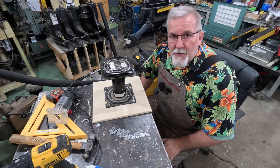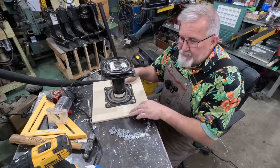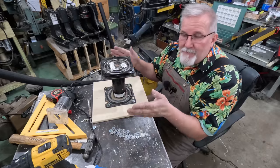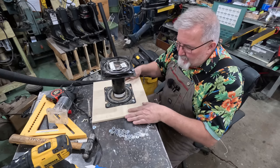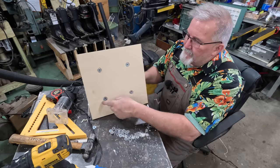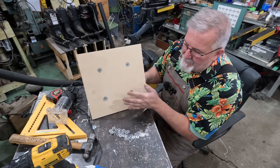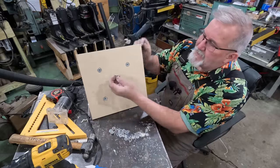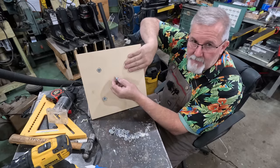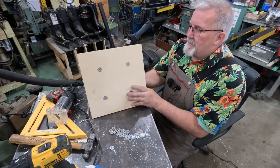Folks, let's catch you up as to where we're at right now. I've obviously cut the boards. I just ran them across my corner rounding router setup that I have on my little bench for knocking the corners off, so we don't have any sharp edges up top. We took the router and counterbored this a little bit. It doesn't have to be precision or pretty. You're never gonna see it. It's basically to take the thickness of this metal right here and make sure it's flush or just a little bit below flush, so this won't be making contact with the seat down below it.